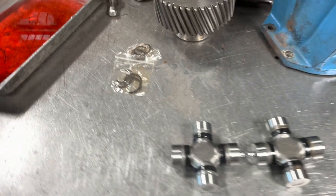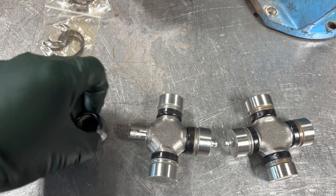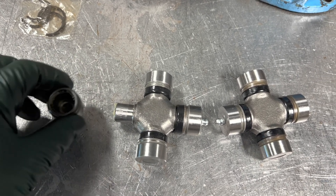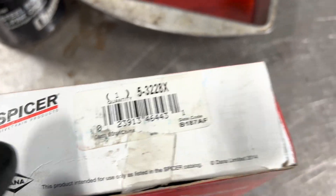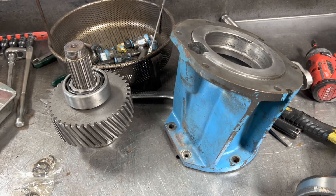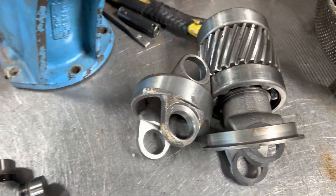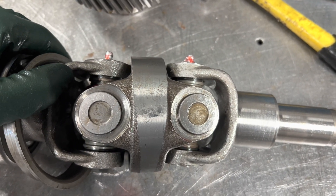Working on my Paragon PV-32R, getting ready to put the U-joints in. Here's another tip: these U-joints have seals on them. Being as this transmission runs transmission fluid, we take these seals out because we want transmission fluid to get in. The seals come out, I'll put a pump or two of grease in, but transmission fluid will keep this rolling. These are the 5-3228Xs, which are Chrysler joints - that's what these take. 315G in Precision was the old Precision number, but that's what these 3-series take. We'll pop these seals out and get them pressed into our yokes. We've got the U-joints in, got them greased - I'm going to make sure these grease fittings don't hit in there; if not, I'll take them out and put plugs in. They're in nice and smooth, so we'll assemble the V-Drive now.